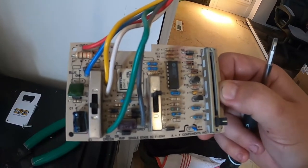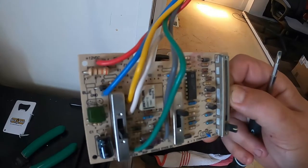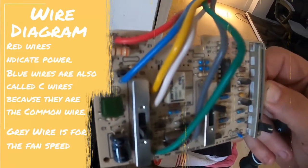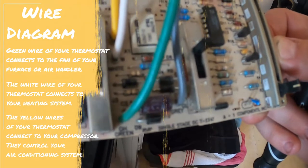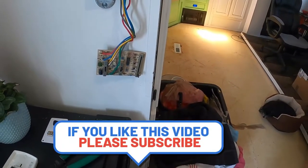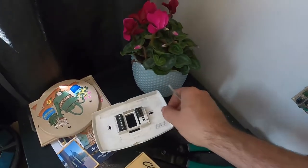On the board itself we have a green wire, gray wire, white wire, yellow, blue, red, etc. The red wire is for your 12-volt — it says right there on the board. Blue is ground. Then you have a couple others: green is green, white is white, yellow is yellow. If you've ever done a replacement thermostat in a sticks-and-bricks home, it uses similar naming on those wires.